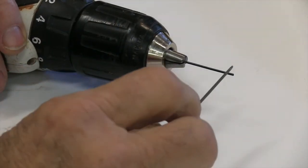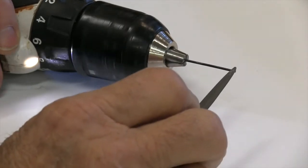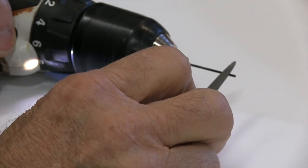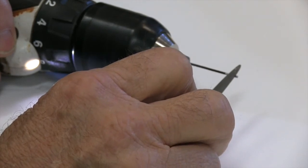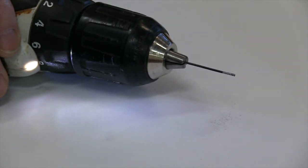Since the gears fit so tightly onto the drive shafts, the splined areas must be reduced in size so they're only 1 or 2 thousandths larger than the diameter of the shaft. I reduced the diameter of the spline parts of the drive shafts by placing the drive shafts in a drill and filing down the splines with a flat needle file while the drive shafts are rotating. Takes a bit of trial and error, but it works.